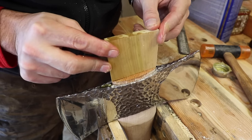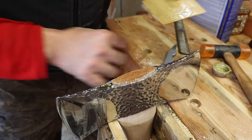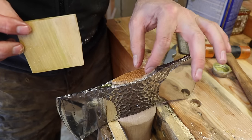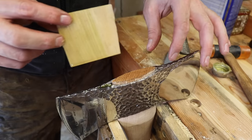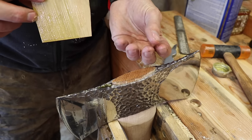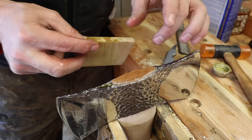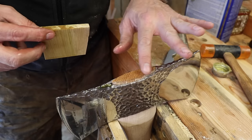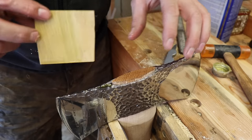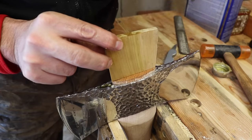You keep applying it every so often. Look at that bit on there — how it's absorbed the boiled linseed oil, because wood is like a series of straws. It dries and gives moisture, receives moisture from the end grain. Some people overlook that — they don't put the boiled linseed oil on there. And that's what goes down there and swells that head, that's what keeps it tight. It's the most important place — that and the other end as well.